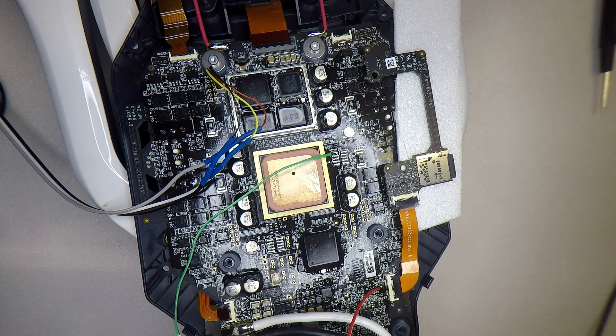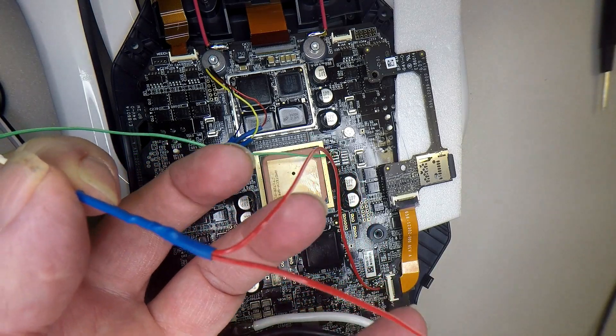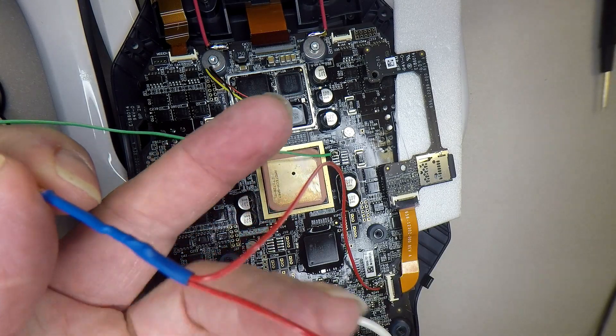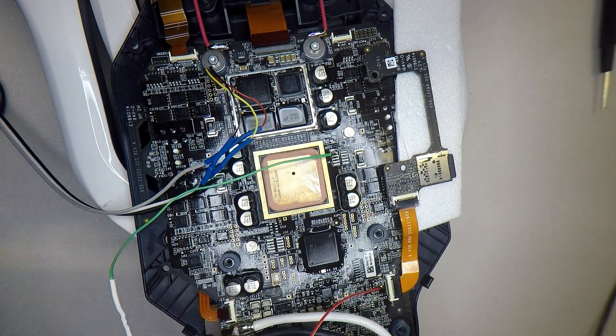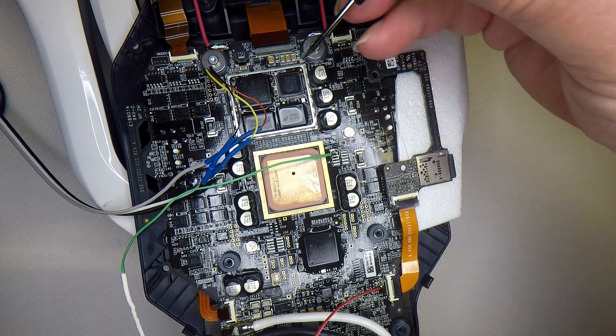At this point we're good to go. We've got our power source, the power out, and the probe — which you can't actually see — connected up to that secondary wire. This one goes to the SD card, this one goes to the probe, and the green is pulling power off the JTAG.